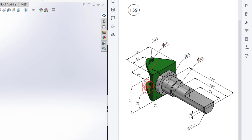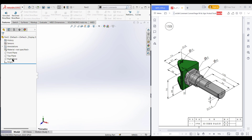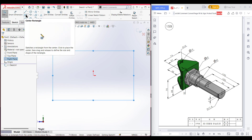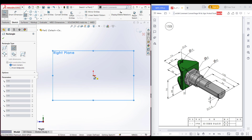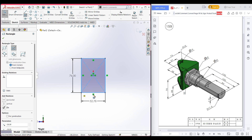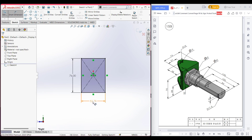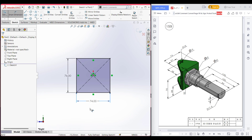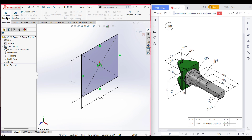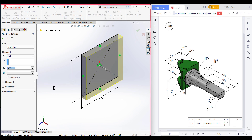We can see we have the same shape in the lower portion, so after drawing the upper portion I will mirror it to the lower portion. I'm selecting the right plane, now sketch, now normal to it. Select the center rectangle, place it here, and dimension it to 76 by 74 units. Now go to features and extrude boss it to 10 units, reversing the direction.